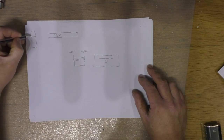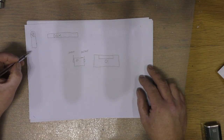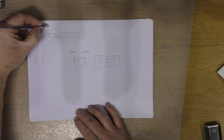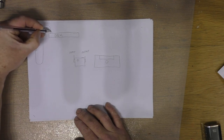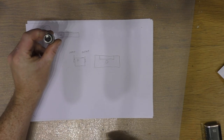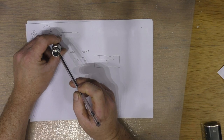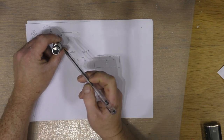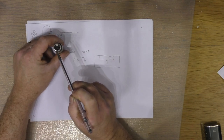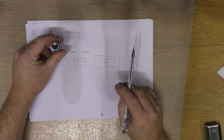Here's our microphone — whatever it may be, condenser or dynamic. We have our XLR lead which comes from that into the DBX, so this is balanced. With the XLR, all three pins are used. If you're not familiar with an XLR cable, you have three connections marked on the black plastic: pin one is the ground, pin two is the hot or audio plus.